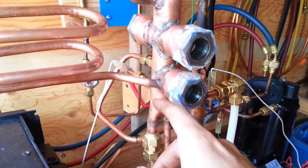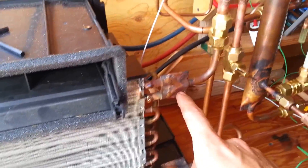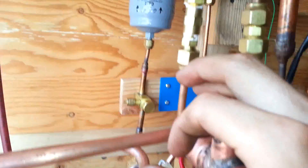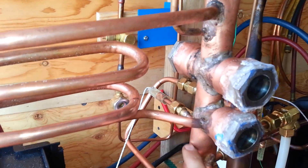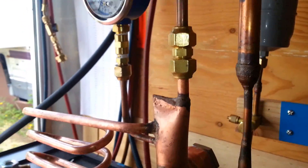There are three lines coming in the bottom. One of them is the refrigerant from the refrigerant control from the medium pressure column, so it's feeding mostly liquid in. The back one actually drains liquid into an evaporator coil, and liquid-vapor can overflow back into the tank and be separated. We have a pressure gauge for the low pressure side, a thermocouple on the back that will take the liquid temperature, and a suction line that draws back to the ejector assembly.